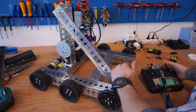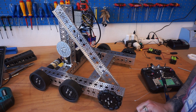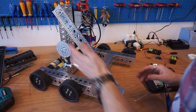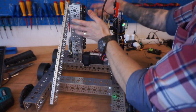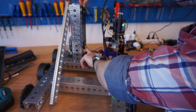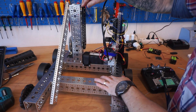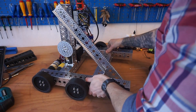You can see it's got quite a bit of speed, but it won't have as much torque as if you were using a torque servo. A few ways to get around that: you can swap to a torque servo, or you can do a gear reduction on your sprockets — going from a smaller sprocket to a larger sprocket up here will give you more torque, though it will reduce some of the speed of your arm.